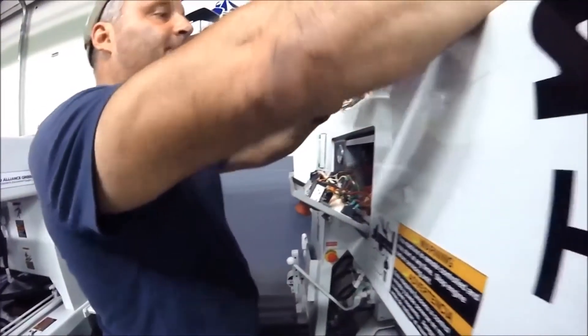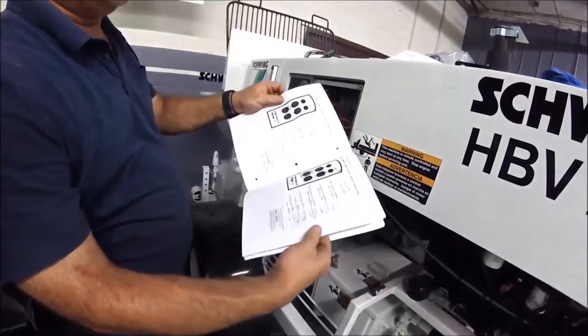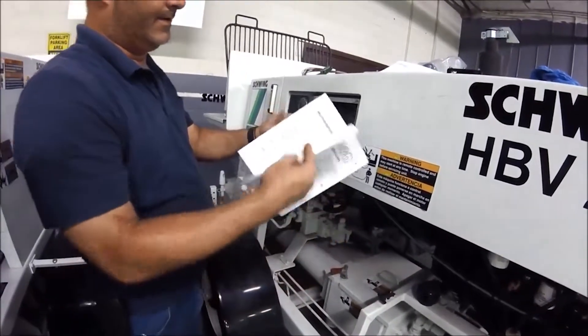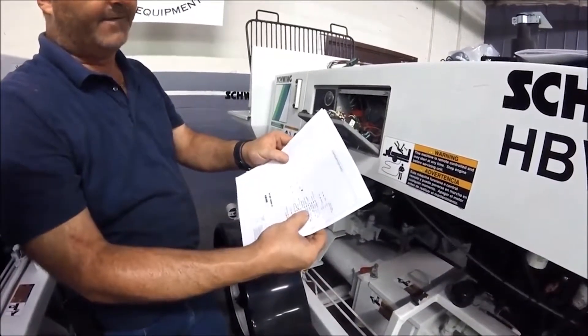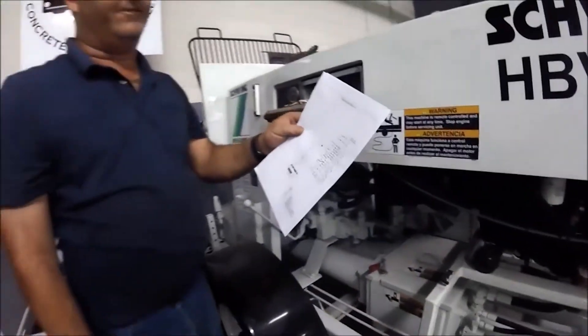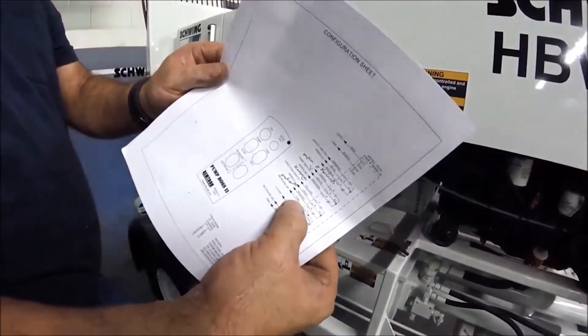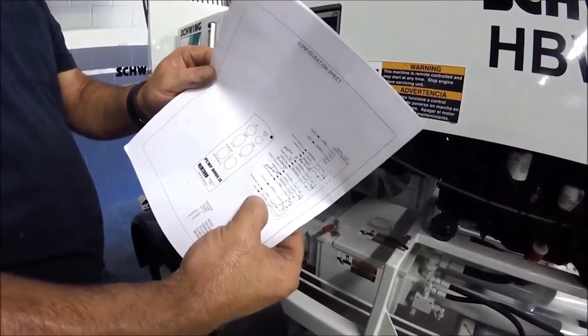If you look in the directions of the book, you're going to see a breakdown sheet. There's your book — this is your operating instructions on how to wire it. Each model is different; there's a slight variance, so only if you have rev up and down volume control. In the book you have a sheet, and I've marked it down so you can easily reference it. You've got white as your power, green as your pump forward, white and yellow as your power, and then yellow as your reverse. This is just for pump on and off. If you've got rev up and down, you've got violet you have to energize, tan for increase, pink for volume going down on RPMs, and then brown for your ground — so you'll have to run two grounds.